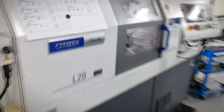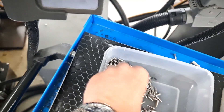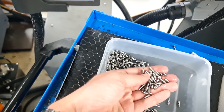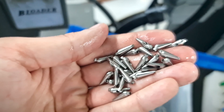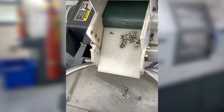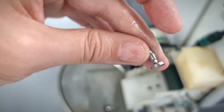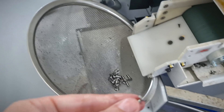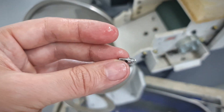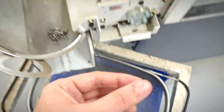As you can see, most of the machines we use for production are Citizen-type. Let's check out what this machine is milling now — it looks like a 15-degree angulated abutment. The one you can see here is almost ready, waiting only for cleaning and polishing. When it first comes out of the machine you can see the base is still connected. Looking at the base you can understand the thickness of the initial titanium bar — from this bar the final abutment is milled. Those attachment marks are easily disconnected and the final product is almost ready.